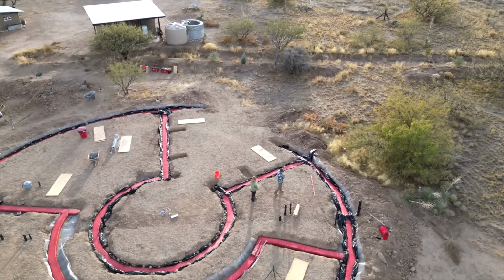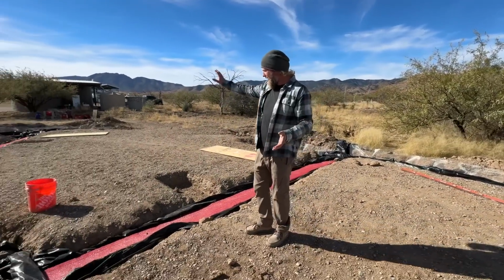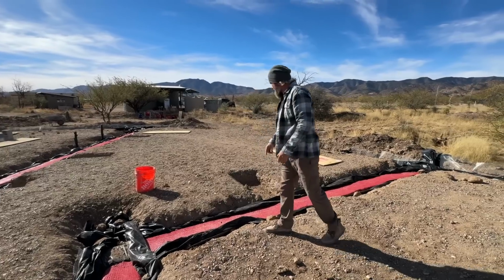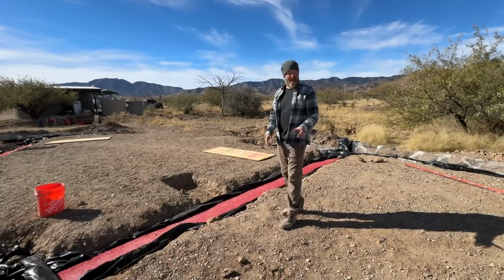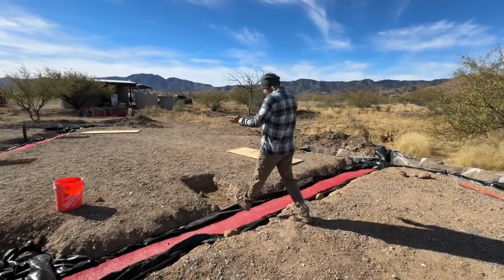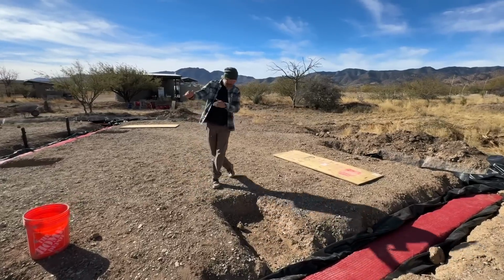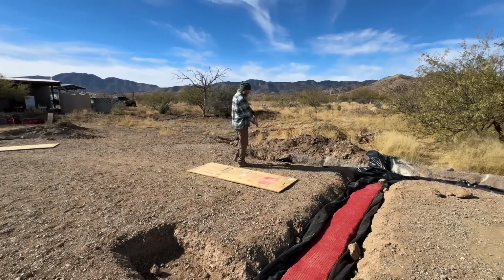Bed is in this big space. On this wall though, again, this will take us out to the outdoor living space, so there will be a door kind of right here to get us out. But because this wall is longer than 10 feet, we do need a buttress. So we decided to do something fun with that. We will have a buttress that comes out, and then we'll have another curved wall probably. It'll go down like this with some bottle bricks, and it'll stop here.